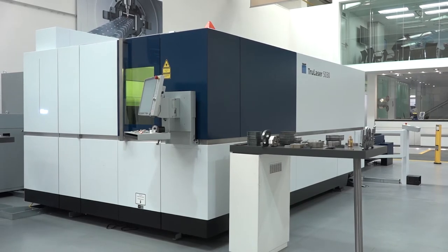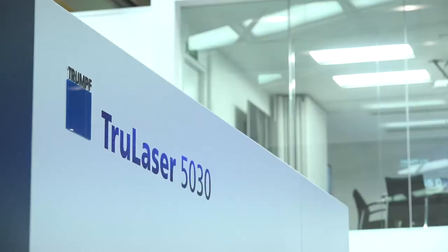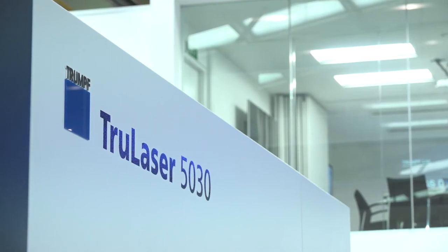This machine can do much broader applications, but the range is still there between CO2 and fiber — don't let the fiber take you in a direction you don't really want to go. It's about productivity and cut quality. Definition and cut quality is more geared towards stainless and aluminium — if you want a mirror finish, CO2 is still king on the thick end. But for a general job shop where the cut quality is acceptable to the customer, this machine will do it all. We always look to learn from doing our videos, and I think I have today — thank you, John.